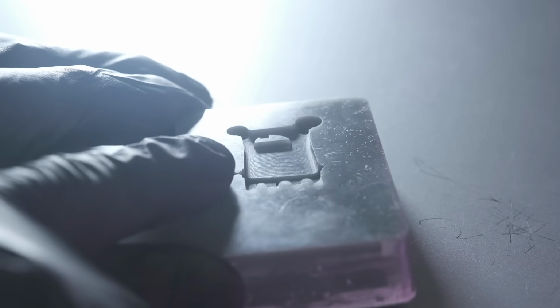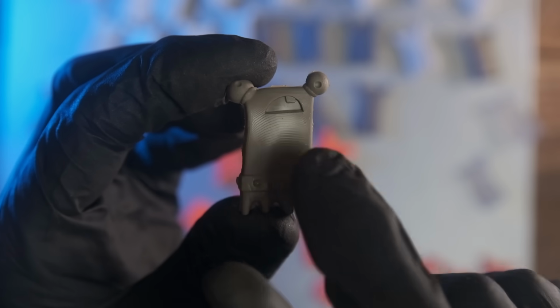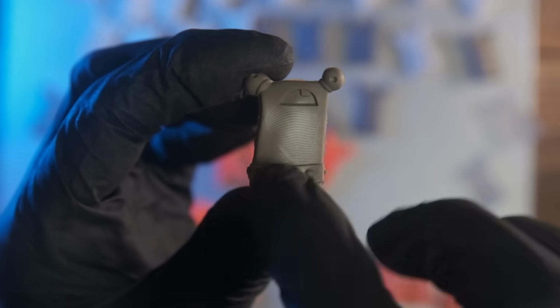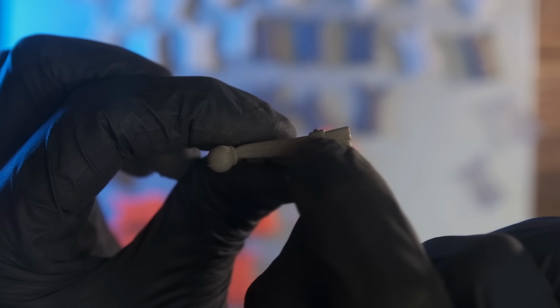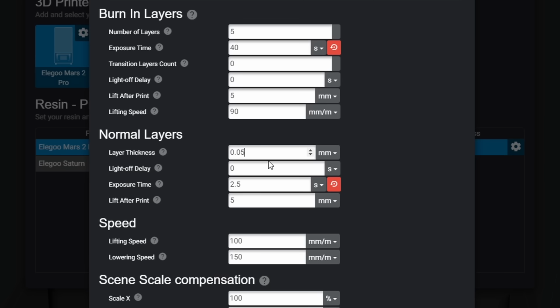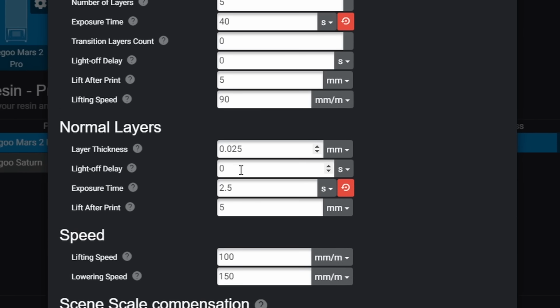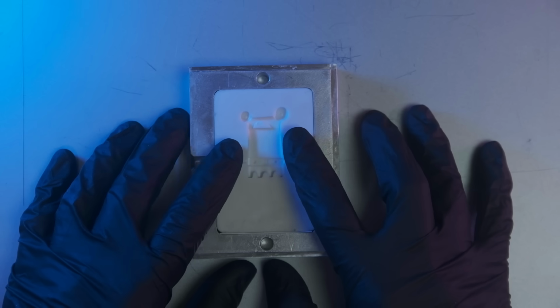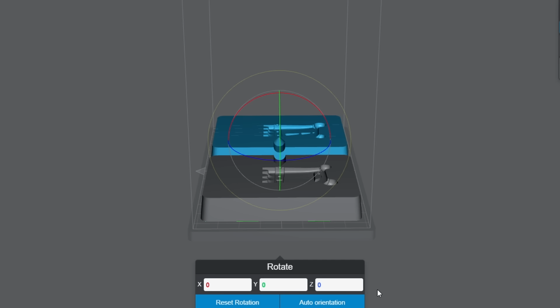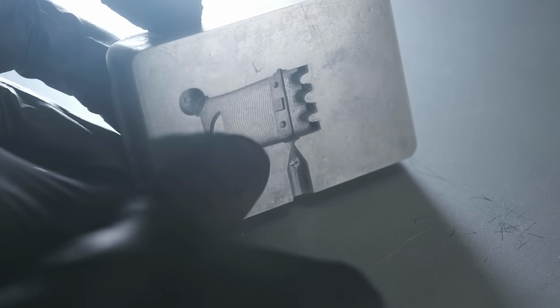One little note right here. The mold had just slight little ridges in it, and the plastic picks up every little detail in your mold, so any little slight gradation right there, the mold lines are really going to show up in there, all right? I printed it at relatively fine settings. I could print it finer, but the way it works with resin-based 3D printing, in a situation like that where your mold is laying down, them little ridges are going to be more apt to show up.